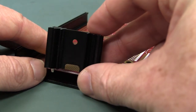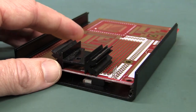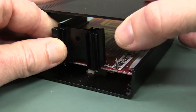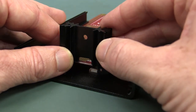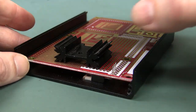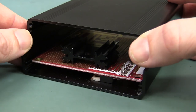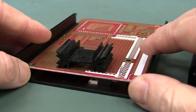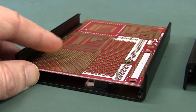Or you could dissipate heat internally with just a regular freestanding heatsink like that, or a flatter one, provided it didn't touch the top of your case. If you want to keep the tab of your voltage regulator or power transistor isolated from the case, which is usually what you want, you can do that. But the problem with internal heatsinks is that you've usually got a sealed case with no fan, so all that heat can build up inside, especially if you're using a battery-powered product — you don't want your batteries getting hot. So dissipating heat out to your case is a fairly decent option.